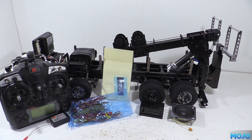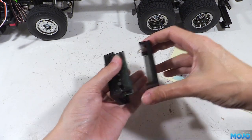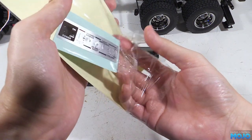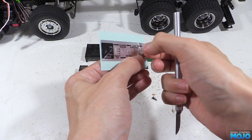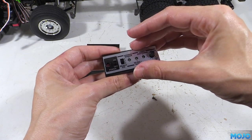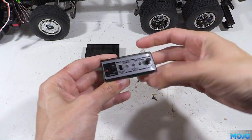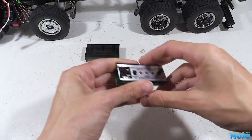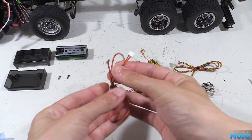Still quite usable but we'll need a little bit of thought on the setup. First job is to connect the control box — it's held together with two screws that get removed so we can separate the halves. Then from the sticker bag we find a chrome sticker for the front of the panel; we carefully remove the bits that block the holes, peel and line it up. Next we need to find the three cables that connect to the panel: the three, five and seven pin cables. They're easy to find as all the LEDs and coupler switch are two pin.